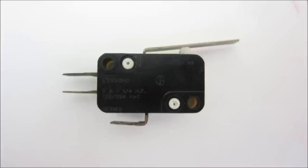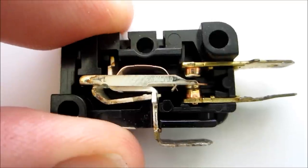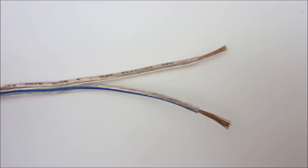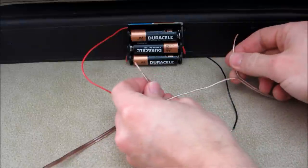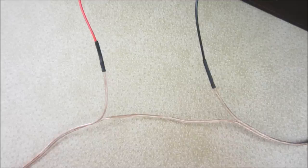To turn the light off when the briefcase is shut, I used a normally closed momentary switch. This switch disconnects the circuit when the button is pressed — it's the same kind of switch that's used to turn the light in your refrigerator on and off. To connect all the parts, I used a piece of insulated speaker wire. I connected one end of the wires to the terminals on the switch, then the other end to the LED assembly. I cut one of the wires at the midpoint and connected each of the two cut pieces to the battery pack.